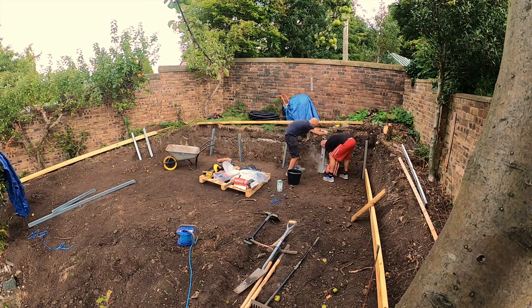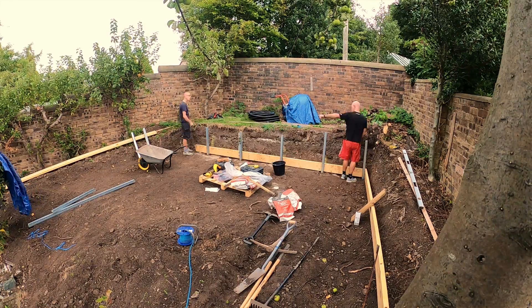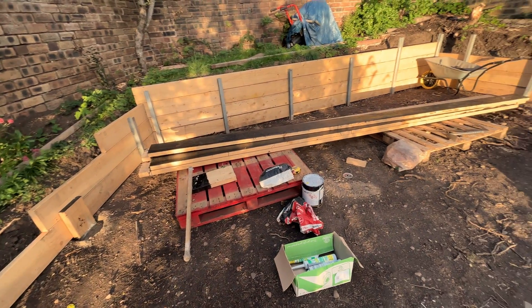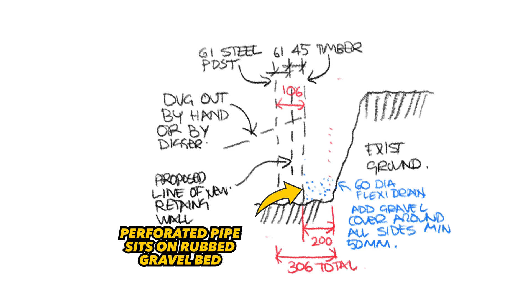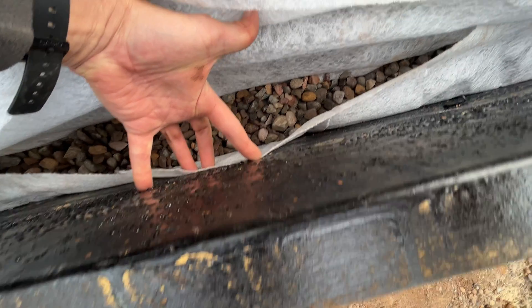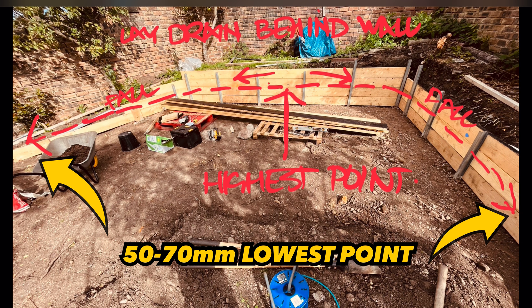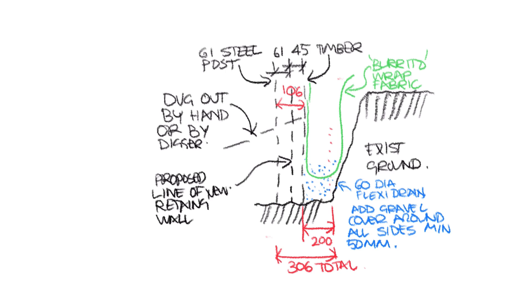With our setting out done and your dig complete and your wall in place, it's time to install our field drain. I'm going to first lay some gravel into the base of the gap that we've left — that's going to create the base for our perforated pipe to sit on. I want around 75 millimetres or 3 inches of cover at its lowest point, so I'll estimate around 250 millimetres at its highest point in the centre of the wall, since the pipe is going to fall in both directions.